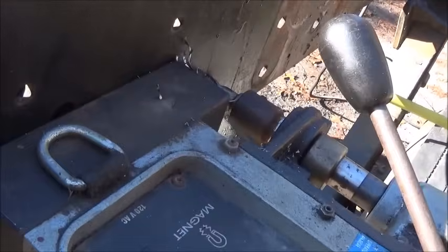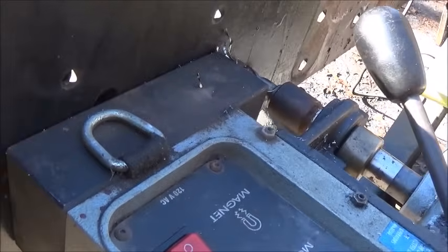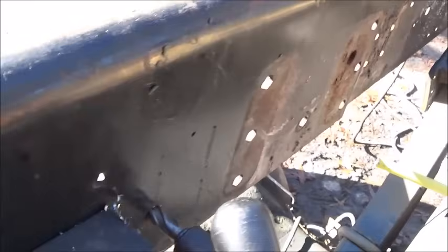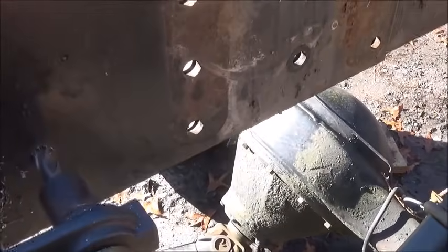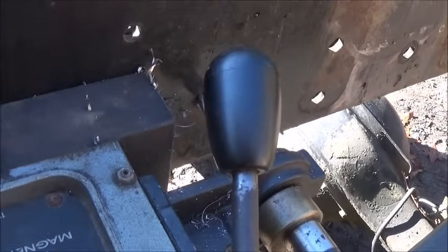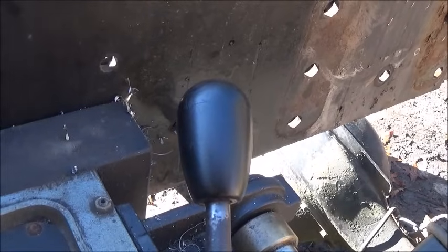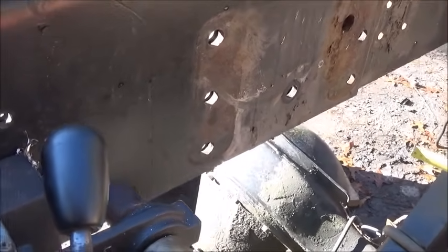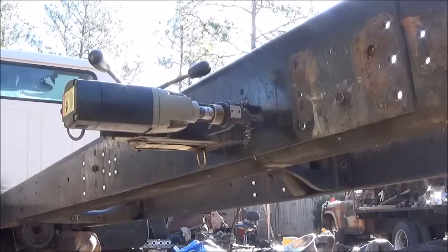Okay, so when I went through this thing, you could feel the frame pushing away on the inside because we're magnetized to the outer frame, but we're actually drilling on the inner frame. So I got to get a bolt in there, tighten it down before I go any farther, because I could just feel it, and I don't want to get in a bind with my bit. Rotary broach bits are too expensive. All right, much better.